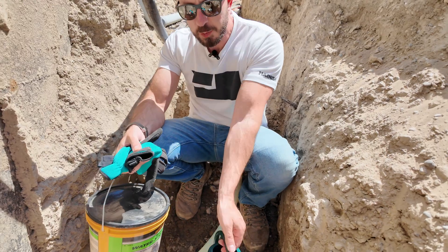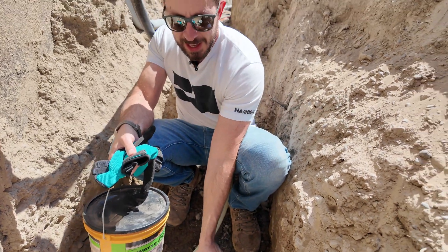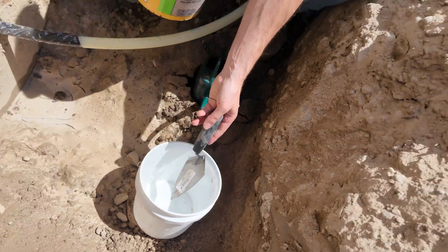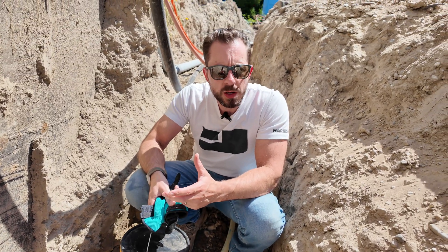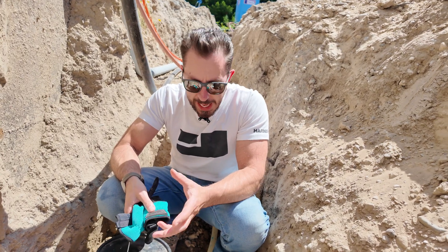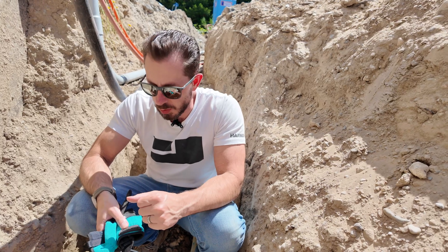A couple of other things — hopefully this will be enough water for me, a little watering can. And then I can mix it in with my hands; I'm going to see if I can use my handy dandy trowel here, and then just a little mixing bucket. It's a four-to-one proportion. It's got cement, sand, and admixtures — so not really big aggregate or really big rocks.